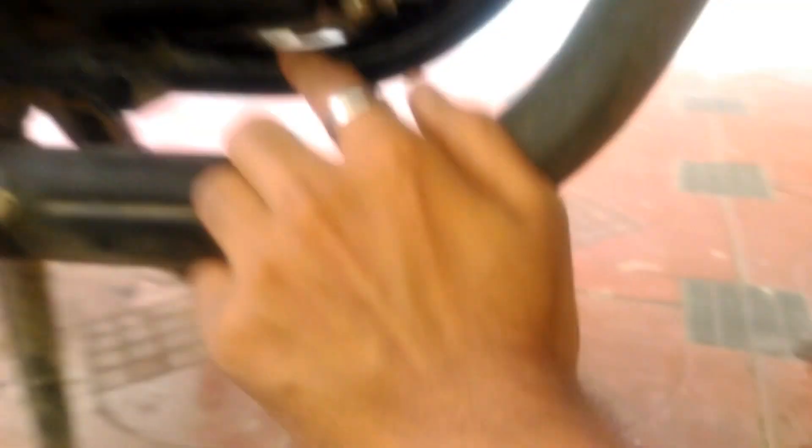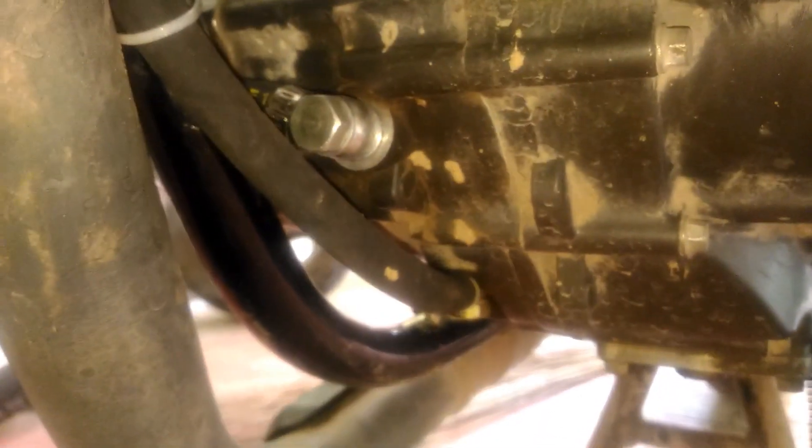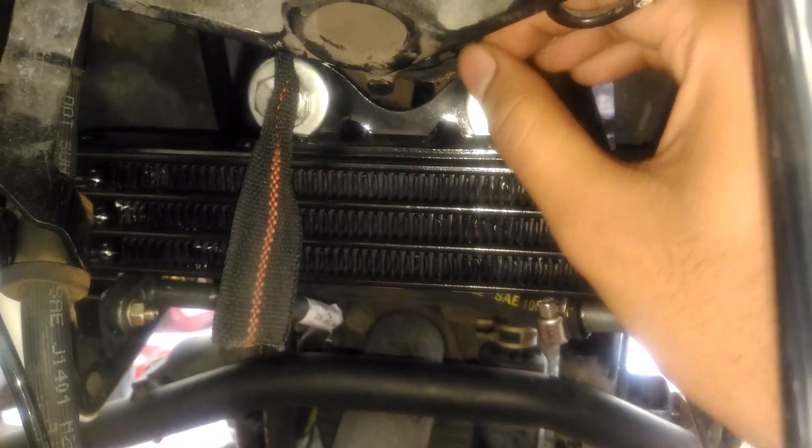After installation, remove your old oil and fill it up with 1.2 liters of oil. If it is also time to change your oil seal, please do change it. My suggestion is to change both your oil and the oil strainer/filter, because it will have collected a lot of dust and wear from gear parts. For good performance, use 10W40 oil.